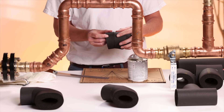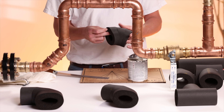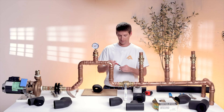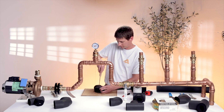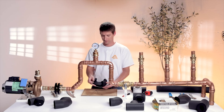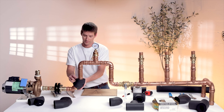As before, make a seam cut to fit the insulation around the pipe to prepare it for installation. You can mark your cuts with a marker to make your cut lines visible. Always measure twice and cut once. Now, let's cut the seam right in the middle of the fitting, just about here. Next, perform a quick dry fit to ensure everything aligns perfectly before applying adhesive.